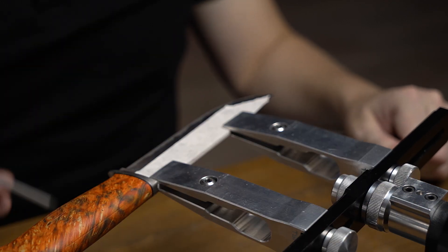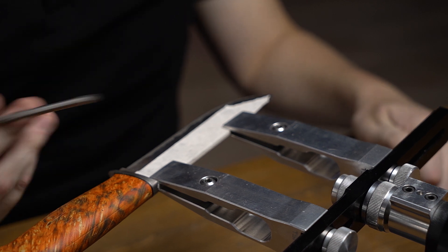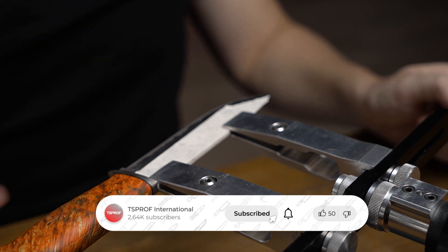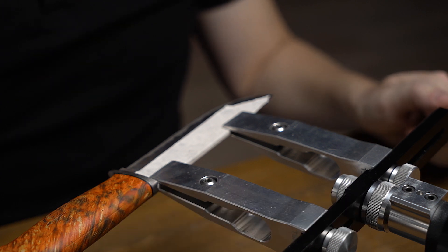As for clamping, this is a full flat grind knife, but next to the bolster there is a straight flat part where we can reliably clamp the knife. In this area we can clamp with the second clamp which holds the knife in the right position. We are clamping the blade right in the center relative to the sharpening frame.